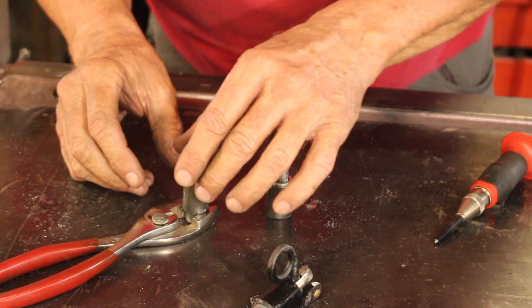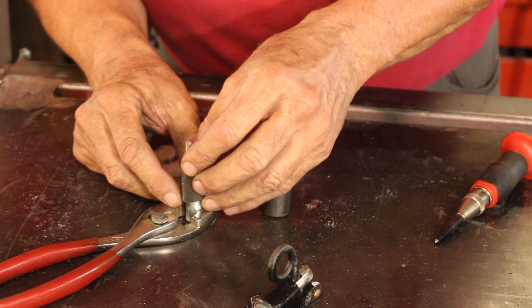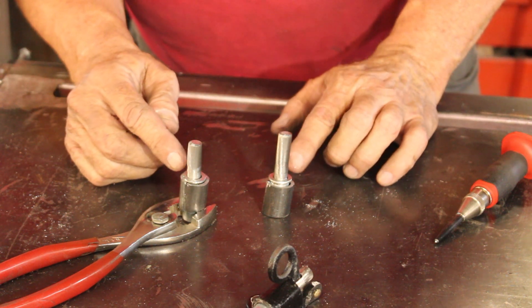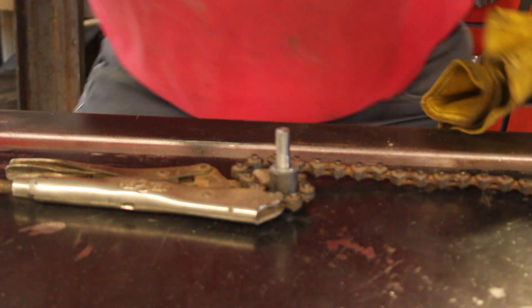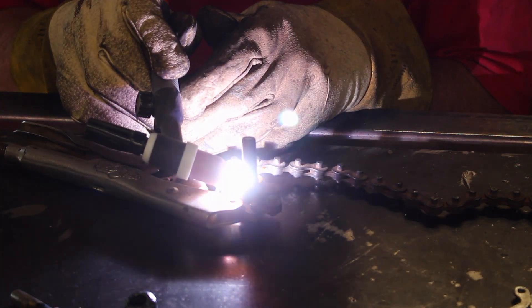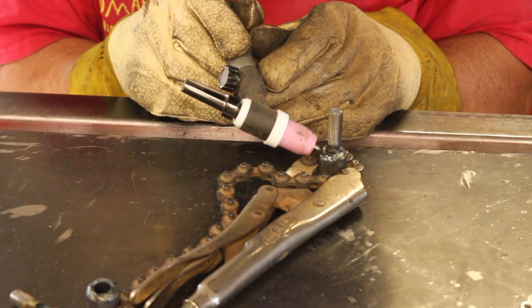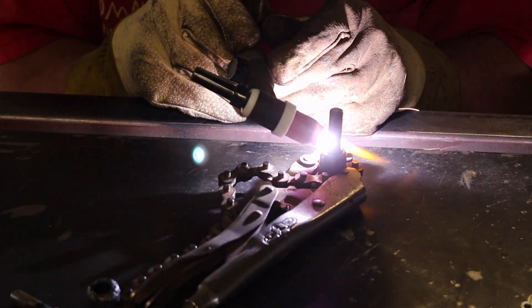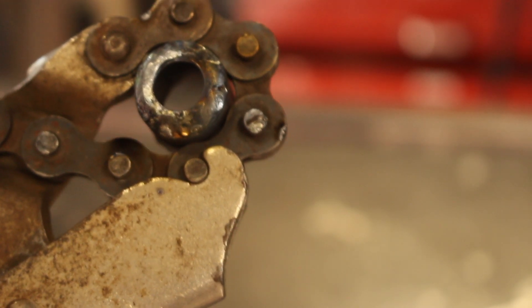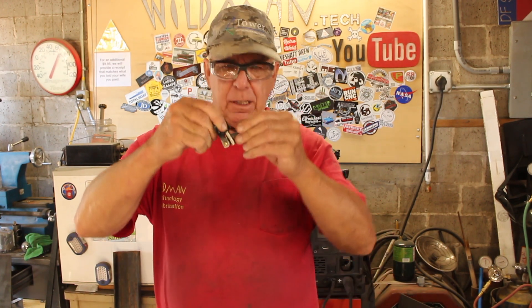Here's what I've come up with: I've got my split tube that has shrunk down and I've got these washers that I drilled holes in to fit the little plunger there. Now we're going to weld that washer onto the tube — I've got to break out the TIG welder. I'll just start by tacking it. I'll admit that's not my best work but I don't do TIG very much. It'll hold. Now what we need to do is add the mounting wings and the place where it's going to pivot.